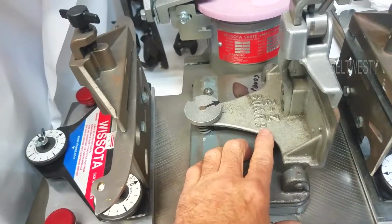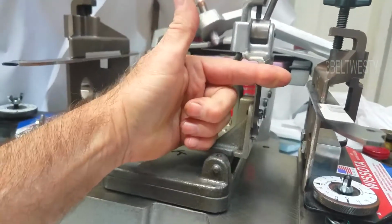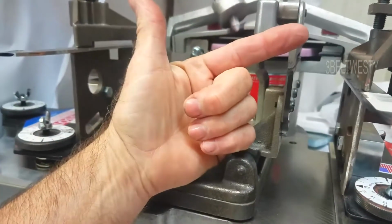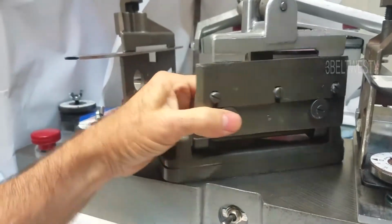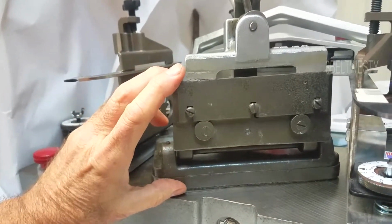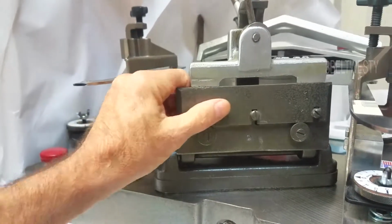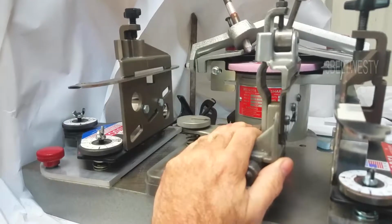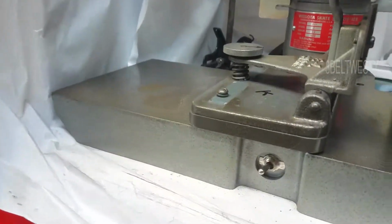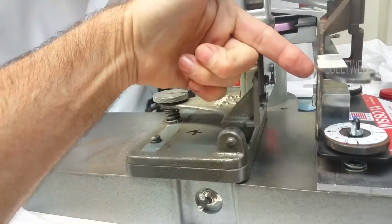And on the Easy Sharp one, it just has a fixed height and then you're tilting it here. Because the blade is not right here, it's sticking out and you're pivoting from here, it's either going to go down or go up a little bit. So they have one, I believe, for figure and hockey where the nominal Z height is cammed in differently for the 2 different thicknesses. Hockey's around 110 thousandths, and figure maybe 140 to 150, about 30 thousandths difference, depending on the skate blade. And this is the tilt indicator. That's actually the Z height. It changes the Z height because it's not pivoting right here, it's pivoting off to the side. So it goes down or goes back up.